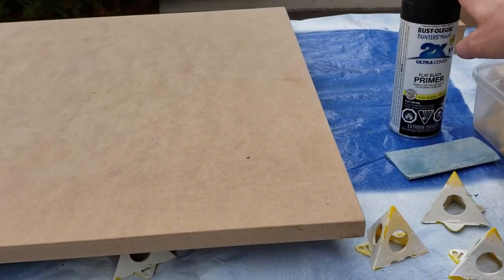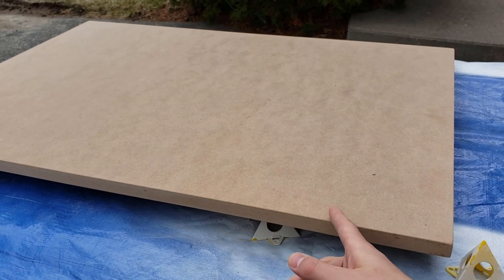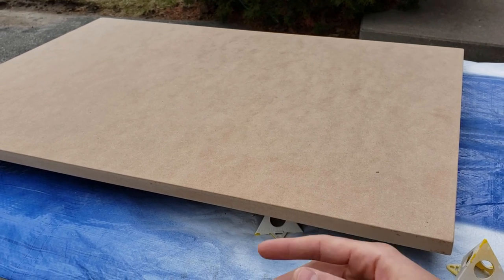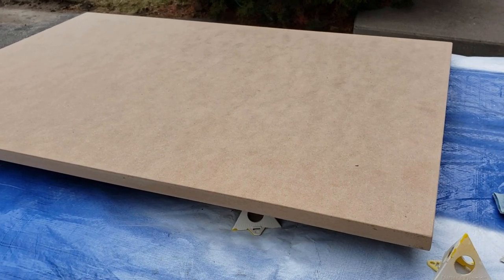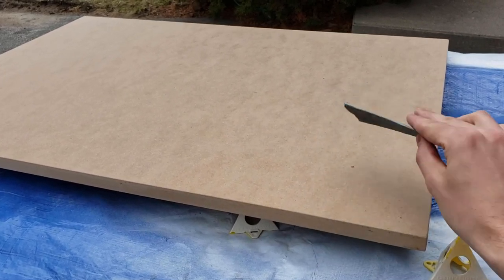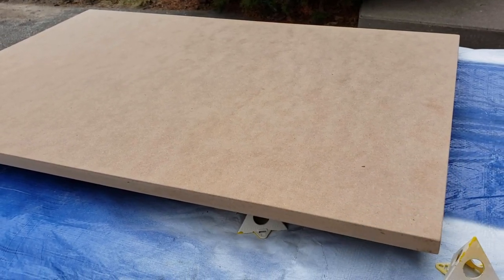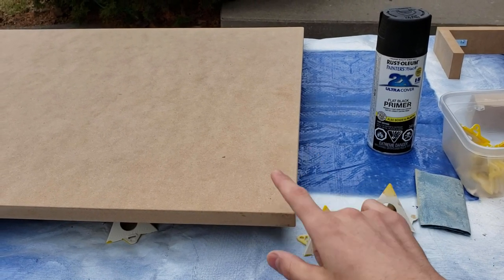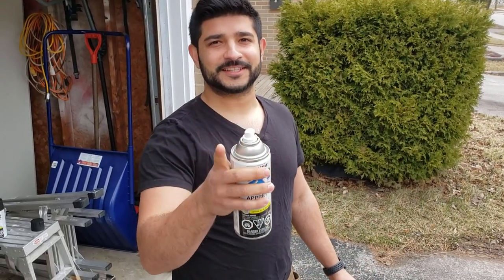When working on spray paint or regular paint projects, onto the primer — we're going to be priming the entire surface. It is a raw wood material, so we always recommend using a primer on these types of materials as well as laminate, as that's going to ensure maximum durability, bond, and adhesion. Speaking of bond and adhesion, use some 120 to 150 grit sandpaper, go over the entire surface, lightly give it a scuff sand, and remove any dust before spraying with primer — that's again going to increase bond, maximum adhesion, and durability.